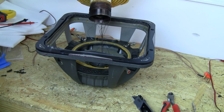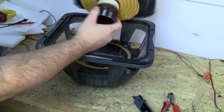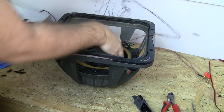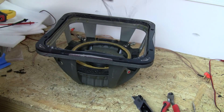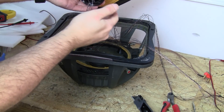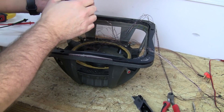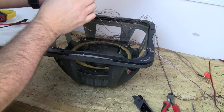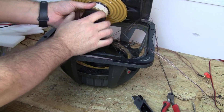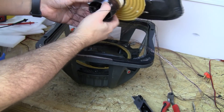This has been unwound and is sliding off the former, and there's a lot of it left in here. The coil definitely did get hot — it is discolored, but there are no burn marks and it's not bubbled. So this just plain had too much power on it; it got too hot and started to slide off the former. There doesn't appear to be any clipping.